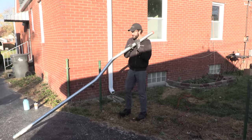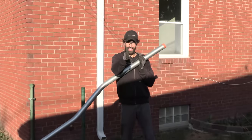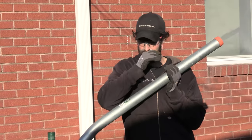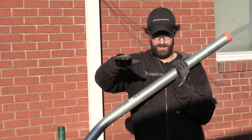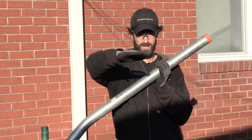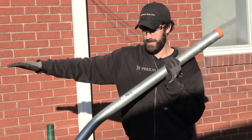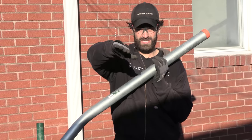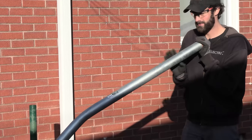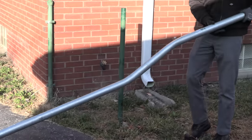The question is the best place to approach. So I should have had my conduit in a single plane. And what I did was, how do I describe this? That first offset, instead of being in a true horizontal plane, it was actually probably sagging towards the ground a little bit because I didn't have it perfectly level. So when we bent that second one, we ended up with a three-dimensional bend instead of a two-dimensional bend. So I think I want to put the bender on.